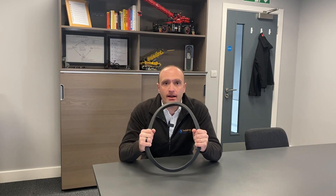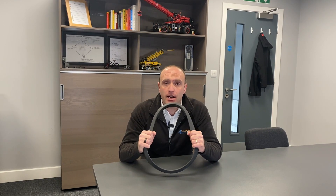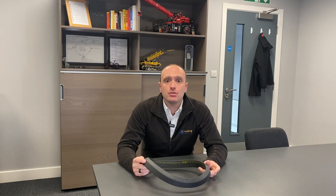Seals are the thing that make a vacuum lifter safe or unsafe, and if a vacuum lifter becomes unsafe there can potentially be quite deadly consequences because things can drop from them and hit people. For this very reason you should look after these seals, and if you've got any signs of wear or damage in them, you should change them.